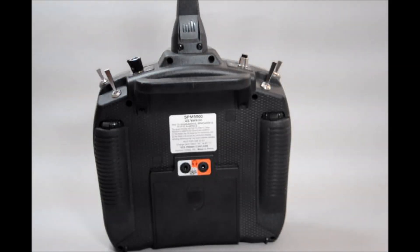However, you may not need to use that cable as the DX9 features a wireless BuddyBox trainer system that frees you from being tethered to your student, making training easier and with less hassle. At the bottom of the case is a battery box cover. Inside, the DX9 comes equipped with a 2000 milliamp lithium-based battery pack for the ability to fly all day long. The charger is built into the DX9 and it is automatic, meaning it will shut off automatically when the battery is fully charged. Note: despite being equipped with an automatic charger, for your safety, never leave a charging battery unattended.